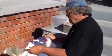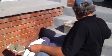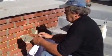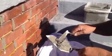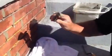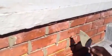If you try and do that dry, it doesn't work out very well. You put a little bit of mortar on a big trowel like this, and take off a little wee bit like that, and then squeeze it right in.